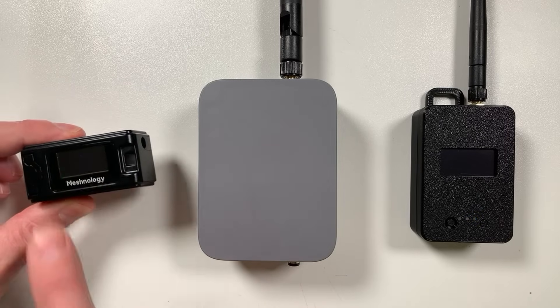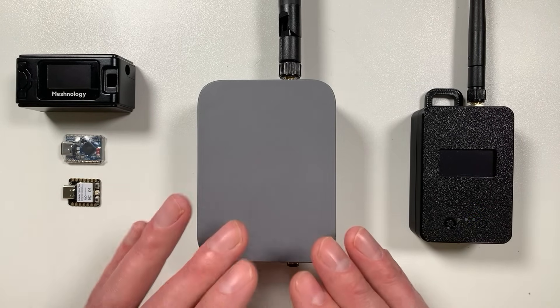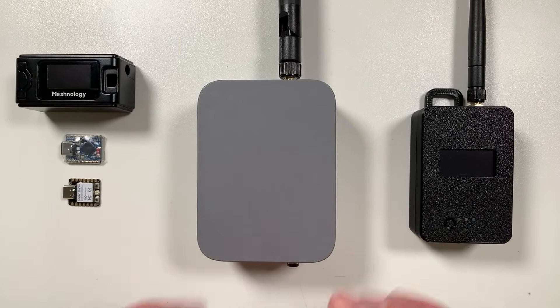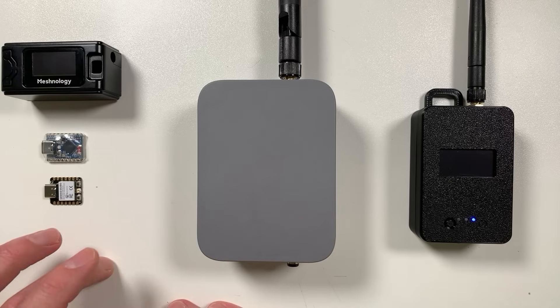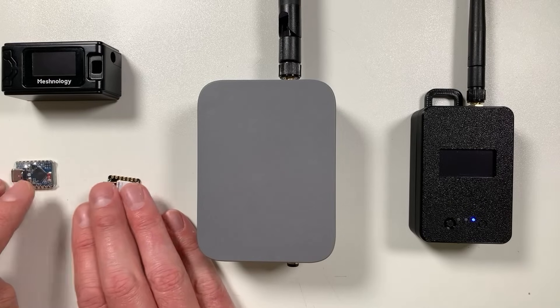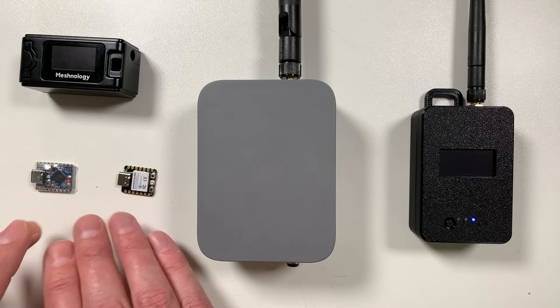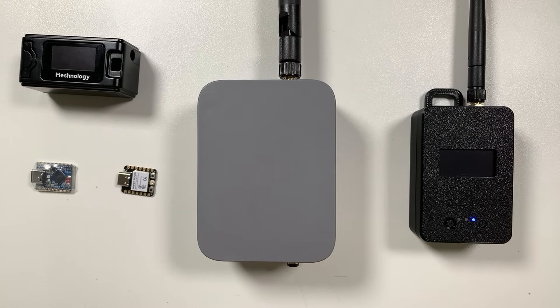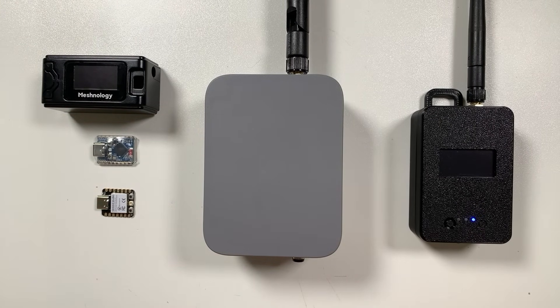This system opens up a lot of possibilities for LoRa MeshCore. Right now it's a simple translator, but we're going to release a proper gateway firmware for a device like this. It would be possible to segregate which devices you want to send across to the LoRa mesh. For example, you could have lots of sensors around that don't cause congestion on the LoRa mesh, because you'd control which devices can go out to the wider mesh — so telemetry from a certain area needn't flood the entire mesh.